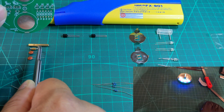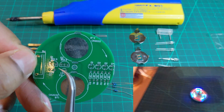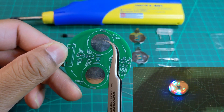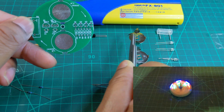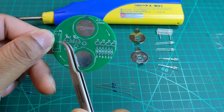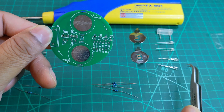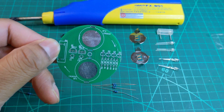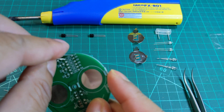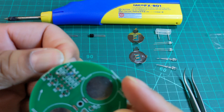How does it work? It has got four LEDs and works in a multivibrator circuit mechanism. There are two transistors which activate with a vibration switch — when you spin it, the vibration switch gets continuity and turns on two of the transistors. Those two transistors are set up in oscillation mode, so one gets on each time, turning two LEDs on and the other two off, creating a very nice little light effect.